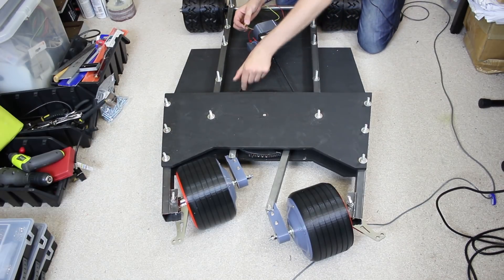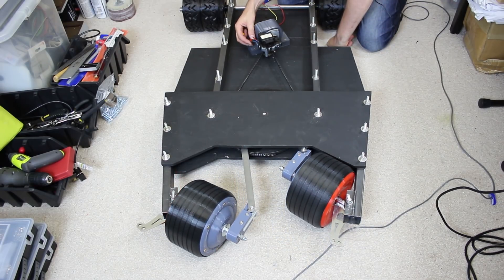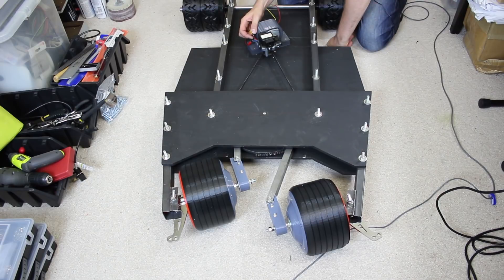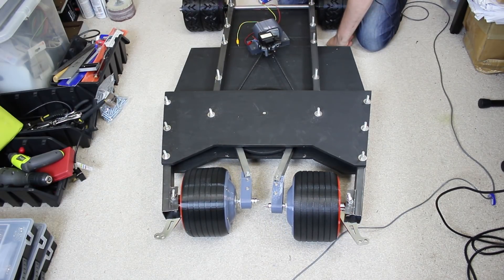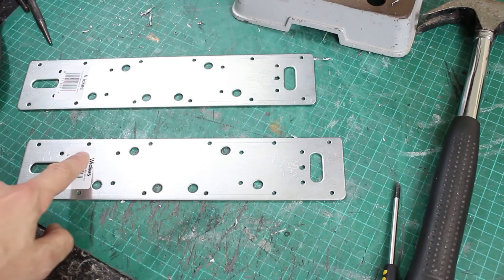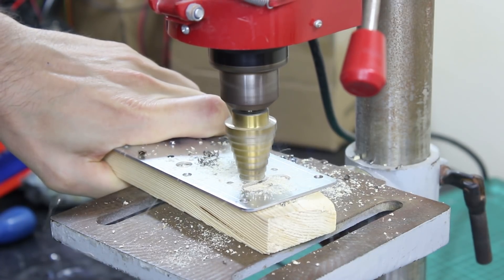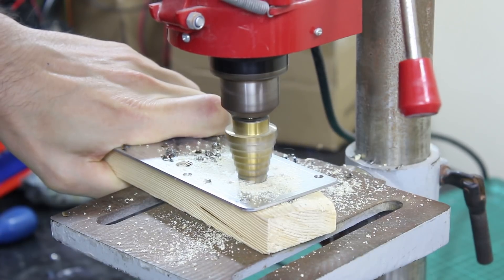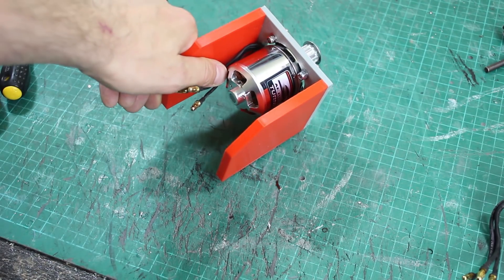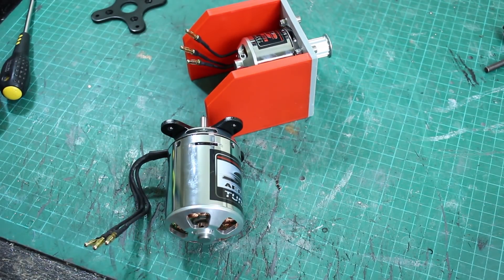Steering seems alright - there's a clicking sound, I think the chain looks slightly twisted where I've screwed it on into the pulley, so I might need a new chain. But it runs pretty quick and I think it's going to be responsive enough. It could run on a higher voltage too - at the moment it's on 12 volts and could run up to 24 if needed. I'm going to use these brackets to mount the main drive motors - interestingly there's a little bat logo on them. The motor I used for the giant Lego electric skateboard was a 280kV 50mm brushless motor.